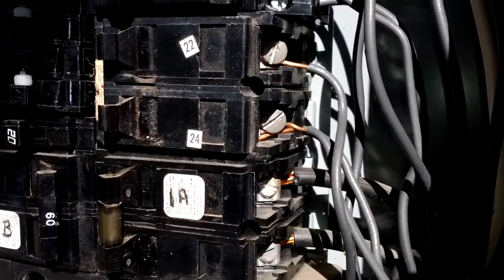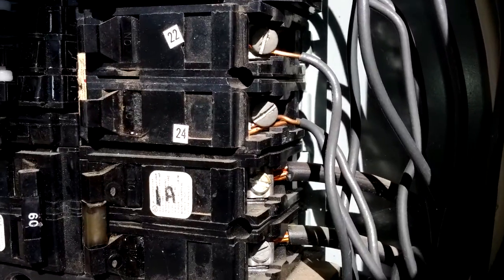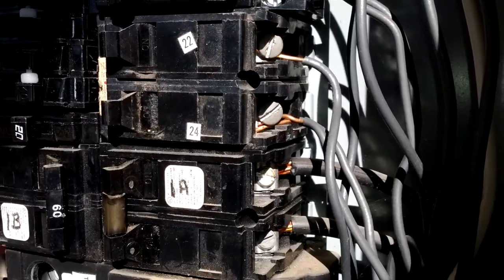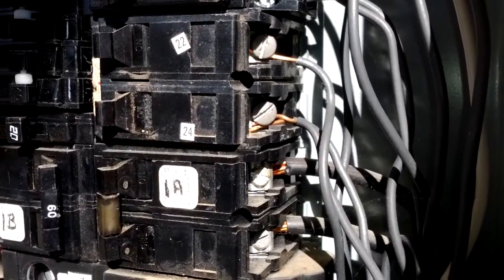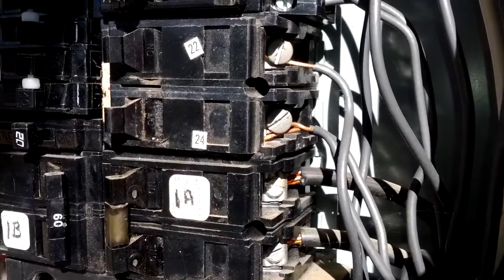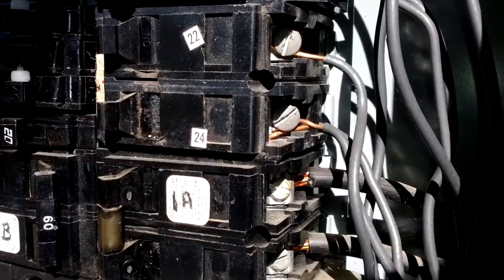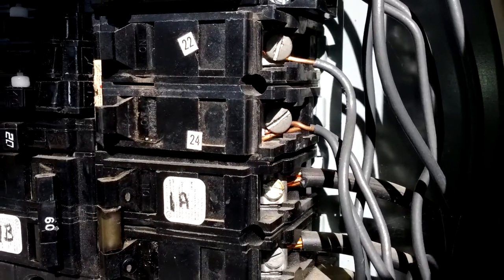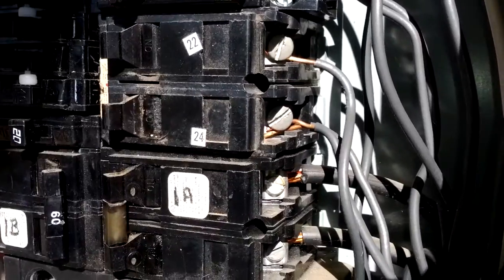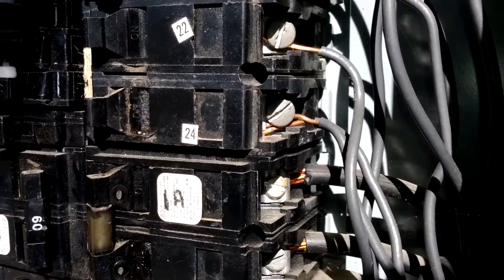This is a condition that's really easy to fix. You just put a new breaker on, provided you have room in the panel, and connect that wire to it so it has its own individual breaker. You can alleviate something more drastic from happening. It's an important finding — it doesn't look like much, but it's one that needs to get taken care of. This item should be taken care of ASAP, given priority over others.